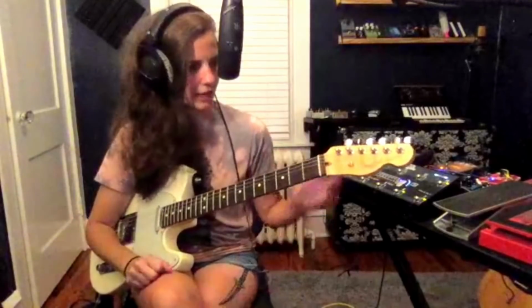A lot of amps have built-in distortion. We touched on that a little bit earlier. That's just those preamps cascading into each other, and you're stacking amounts of gain and getting a lot of saturation. It's funny, because Fender amps, what we use live and on the road and in the studio, aren't really sought after for their distortion. They're just great sounding clean amps, and each model I've played breaks up really great. They're a great platform for your pedals. I don't have an amp with built-in distortion that I use for touring, but obviously that's super common and they sound awesome too. So that's what's going on with the circuitry: those cascading preamps.